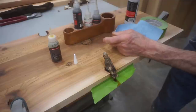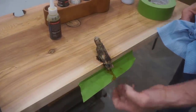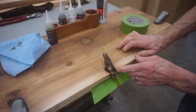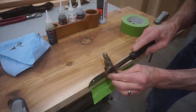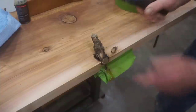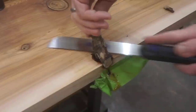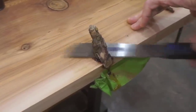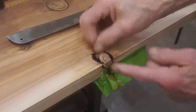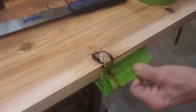I try to keep the tips of the CA bottles wiped down so they don't build up excess glue. You can see even the CA glue that's running off here is setting up because it had accelerator sprayed onto it. Now that I've got a good start on this, I'm going to trim it back a little bit so I can be more focused with the application of CA. I'm just going to use this dovetail saw — I'm cutting it a little proud to the surface here, not flush yet. I'm running this in real time so you can see that the piece of branch is stable enough that I can saw it in place after just a couple of minutes.